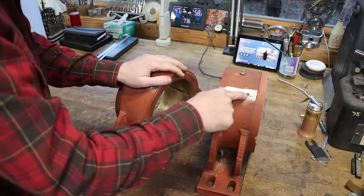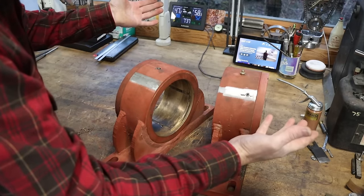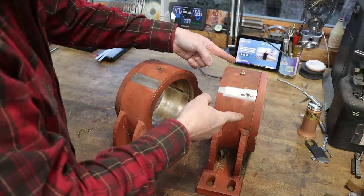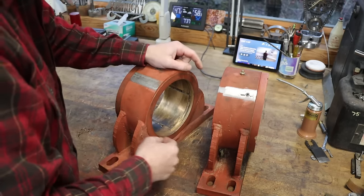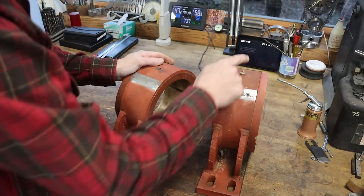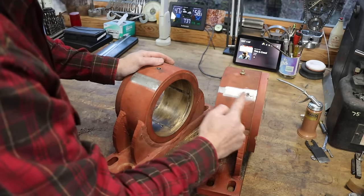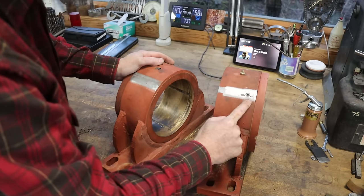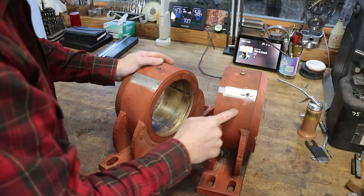There's no risk of anybody screwing that all the way through into the rotating bit in here because it's not drilled all the way through. And if you shear these two set screws, you've got bigger problems than the way that these bushings are attached to the housing. So that's the reasoning behind it, and they're offset, see, not centered, because there's a grease channel that runs down through here, and I didn't want to obstruct that channel.